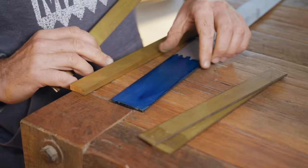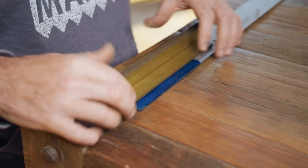I need the sole to be as wide as 2 side pieces plus 1 inch for the infills of the plane, and I've also added another piece, and that's for some extra on the dovetails.